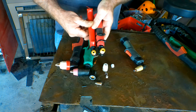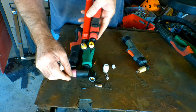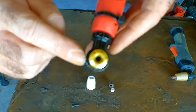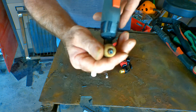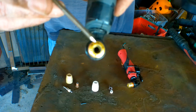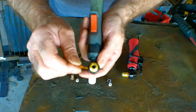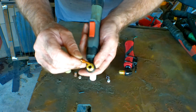So the SG50 here has the screw-in, and the PT31 here — the heads look almost identical. It has the holes here for your swirl ring. Swirl ring goes on top. The only difference is this one here screws in and this one here pushes in. Here's a used PT31 torch that I don't use anymore, for the simple reason that it arcs out in the torch head. You can see inside this torch it's actually arced out all the way around here — because I've been using it and it hasn't been tight with the ceramic and it started vibrating. The electrical current burns out the inside of your torch, and sooner or later you won't be able to cut at all. Even when you put the cutting tip in, you can feel it's quite gritty, and there are lots of sharp bits in there. That's the electrical current that's actually burnt into the copper or bronze or whatever the hell it is.